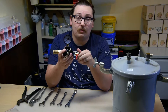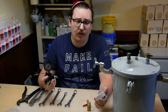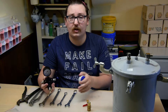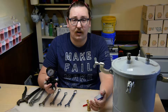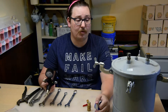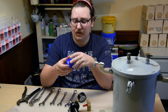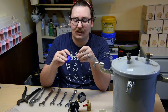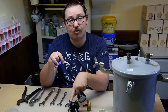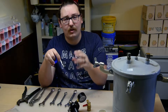The first thing you want to do in prepping these fittings is teflon tape. You can also use Loctite — Loctite red is a very popular option. I like my fittings to be removable in case I ever upgrade to a different pot or something gets damaged, so instead of fighting Loctite off I can just use a little brute force and pop the teflon tape right off. Teflon tape is only going to cost you a buck. It's not sticky or tacky like regular tape — it's made of teflon plastic material and allows us to wrap these threads and close all the tiny gaps between the male and female threads where they meet.